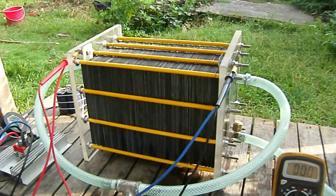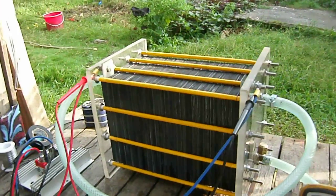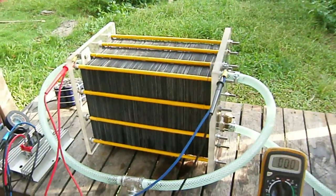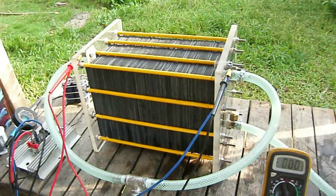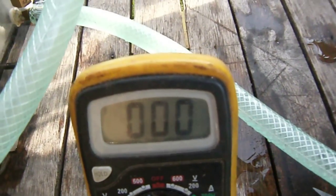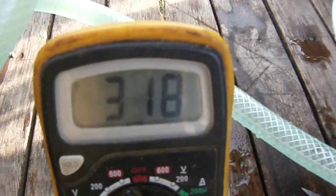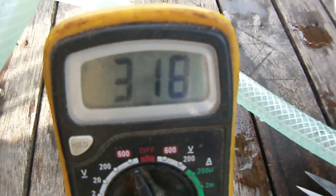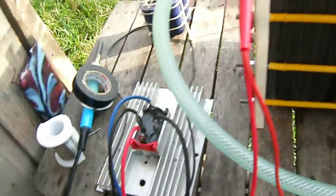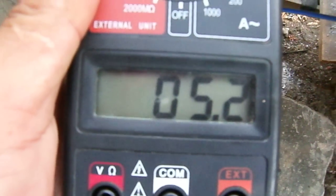You can see the production of this one. So we are going to see how much voltage this supply is putting out. The meter is not registering any voltage at first, but now the voltage is 318 volts DC. And let's take a look at the amperage — we have 5.2 amps.